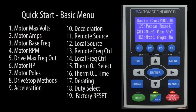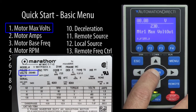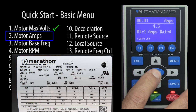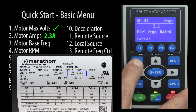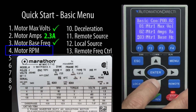Let's see if we can get this motor spinning by changing just a couple parameters. Quick start parameter 1 is the motor's max voltage, which the motor label says is 230 volts — that's the default value, so no change there. Quick start parameter 2 is the full load amperage, which the motor nameplate says is 3.2 amps, so we'll change that and hit enter. Quick start parameter 3 is the motor's base frequency — the default is fine.